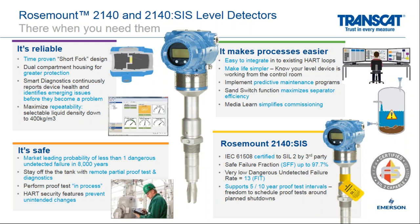So when I mentioned earlier, we're sort of ignoring the liquid level within a vessel. For example, if we have 1400 hertz when the fork is dry, and now you dip it in oil, that'll drop down to about 1100 hertz. Normally that would make a normal switch change from dry to wet. In this instance, we're going to ignore that drop in frequency and look for a frequency more consistent with sand or sediment detection, which is going to be even lower than 1100 hertz.